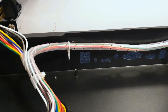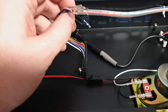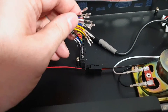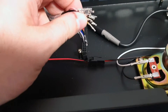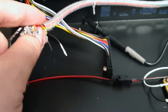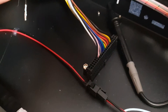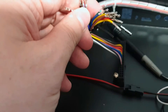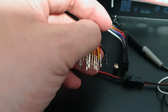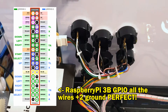As suspected, the entire cabling from one side is here - there's the common ground, and unfortunately this other black one is another signal cable. I might put a dot of Tipp-Ex or a piece of tape around it to mark it. The other buttons are really easy to identify because they're all color coded - one side is definitely one set of colors and the other side the other set. I should have recorded the order they were in, but I've got a photo from earlier and I've made myself a map.